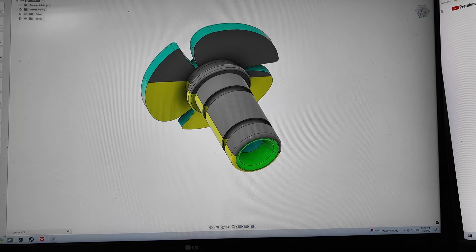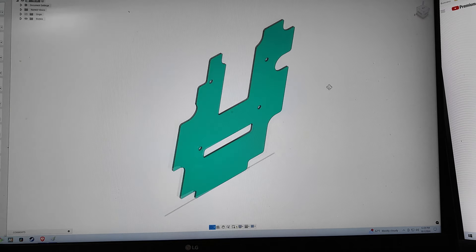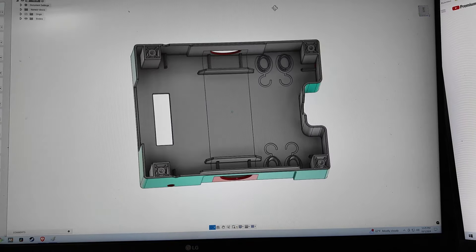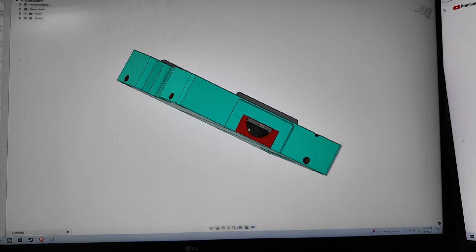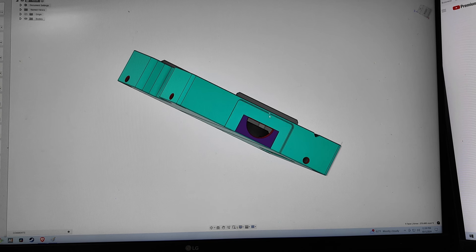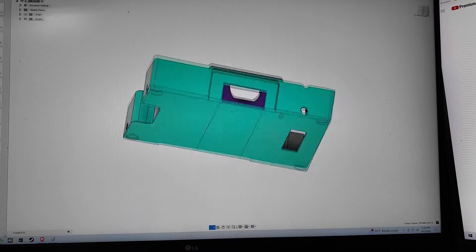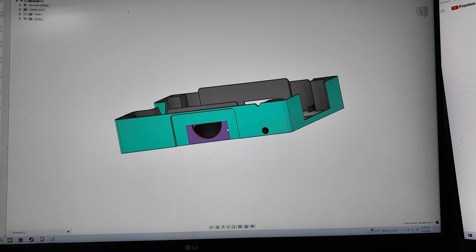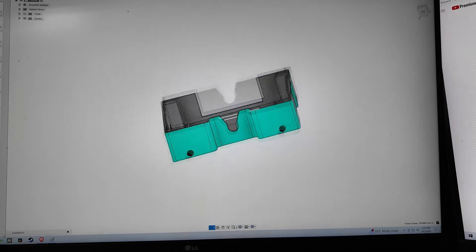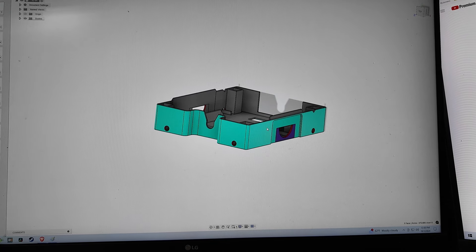I'll go through this process with all of the different molds we're making for this product — that's actually what I'm doing right now, which is kind of why I'm making this video. I'm going through all of these and making sure that the manufacturer and I agree on where all of the different mold lines are going to be. For example, this was the initial proposal from the manufacturer, and I said this purple part should be done differently. They agreed, so now because of that change we won't have this extra mold line. I have them do a proposal, then I review it, and there are a couple of iterations of back and forth. We can do this quickly with models on the computer before any molds are made, because sometimes changing where mold lines go requires a completely new steel mold — so we want to get that agreed upon before any steel is cut.